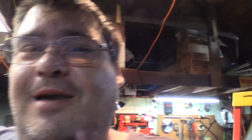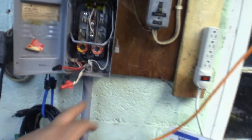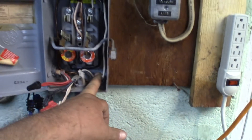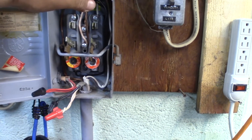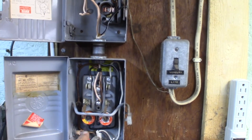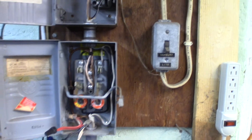It is finally time to redo the electric out here. I've got this 30 amp service coming in to this panel. It had 20 amp fuses in it because whoever wired it up only put 12 gauge wire up to this separate little fuse panel — and of course it has to be on a 30 amp fuse with 10 gauge. Then I put a 20 amp circuit off the other leg of it for my air compressor, my little Harbor Freight one.